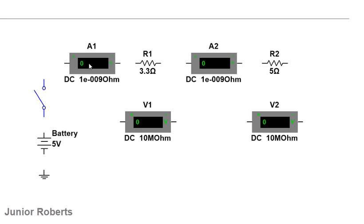Now let's talk about the voltmeters. These two voltmeters are going to measure the potential difference across R1 and the potential difference across R2. Similar to the ammeter, positive must go to positive and negative to negative. The key difference is that instead of connecting a voltmeter in series, we connect it across the component — in parallel with the component. We'll see this when we connect up the circuit.